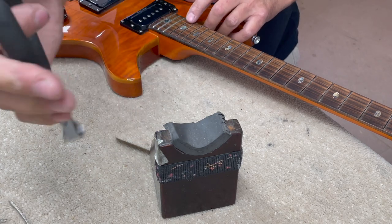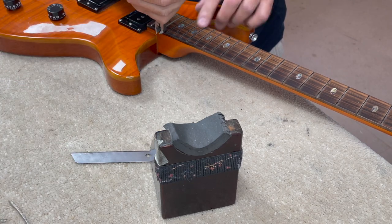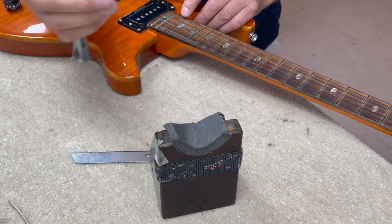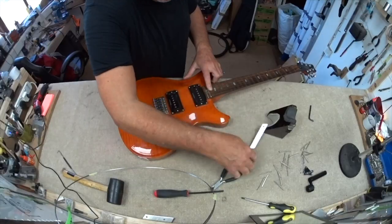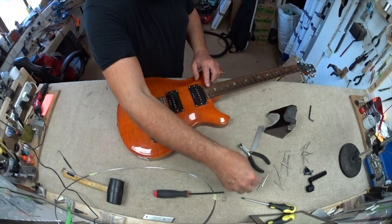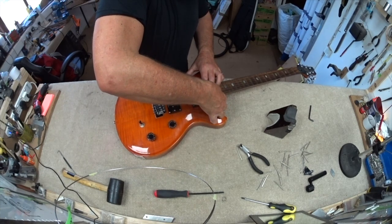In a way, my first stainless steel refret was completely underwhelming, in that I expected some sort of ogre battle or clash of the titans. Queen reference, Ray Harryhausen reference. The only way I could tell that I was doing a stainless steel refret was one thing that people had said, that it's much harder to cut. And fair enough, that's exactly what I found. My trusty fret cutters, I really had to swing on them to get them to cut. A lot of the time I was genuinely afraid that I was going to break them before I got anywhere close to cutting the fret.